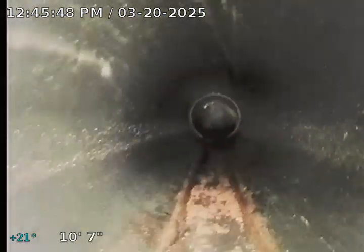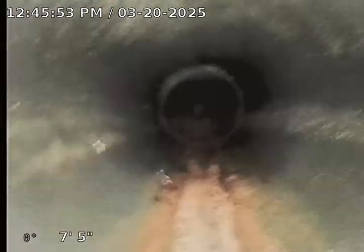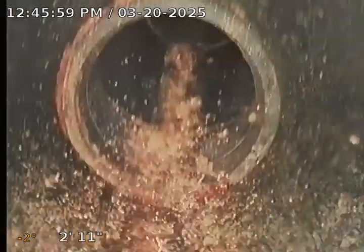You do have other clean outs. There's one located at the rear, but it's plugged up with stucco, and it would require me chipping away at that clean out, which I might not get permission from the owners because it does damage the stucco. So later on, maybe you want to chip that away and have a proper access, or the plumber can do it if there's ever an issue. But right now, it looks good.